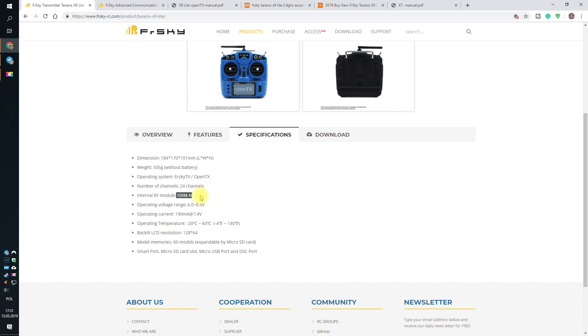If you decide to have this radio as your secondary radio, or a radio for a son or daughter, you will have to flash all the receivers you are using with ACCESS. Because ACCESS on this transmitter is not backward compatible with the previous generation. This is not what happened when FrSky introduced the XJT protocol — back then they kept compatibility with the D-series receivers, so after upgrading to the X, you were still able to bind to D-series. This time, you do not have the possibility to bind to the previous generation X-series or D-series at all.